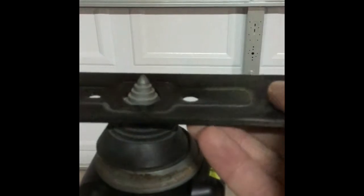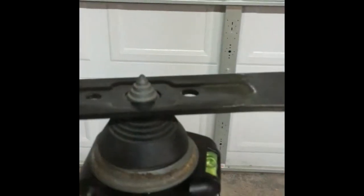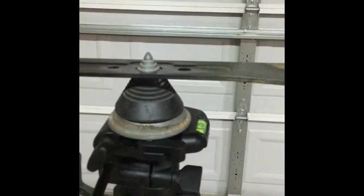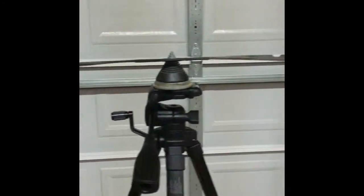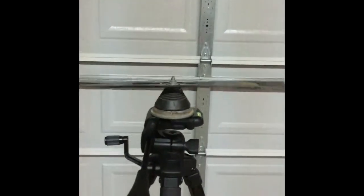Here's our blade and we're going to set it on there just like that. This blade has a little flat notch on it, so you want to concentrate on getting it lined up with the round part and let the flat part sit up a little higher, because it's not going to affect the balance — it's just going to make it sit on there a little differently. That's what it looks like and that's pretty darn good. One thing that makes this blade a little more difficult than a standard flat blade is it has a twist to it, but it also has a gentle bow to it — you can kind of see it against the garage door there — and you don't want to mess that up, that's a design feature.